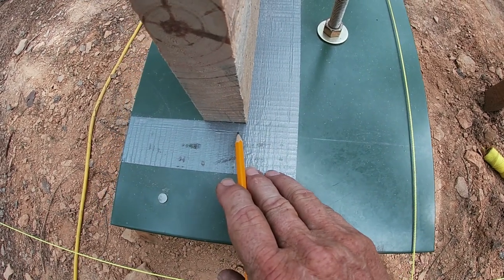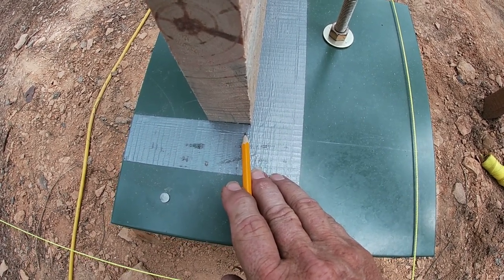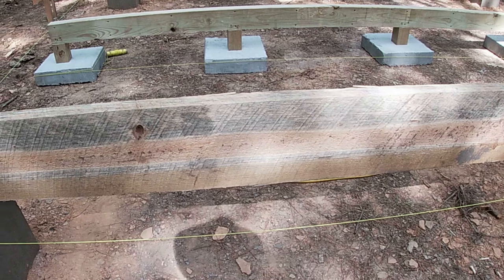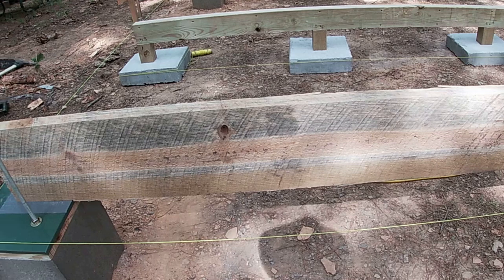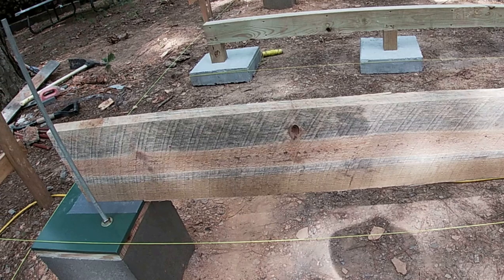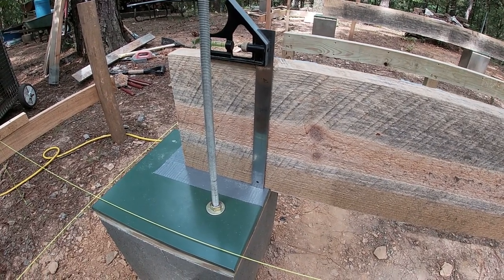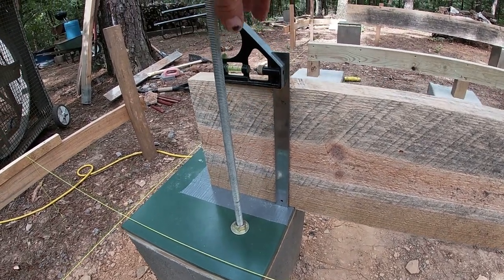It's three-eighths of an inch back from the end of this first two by ten that I've put down here for the beam that'll carry the weight of the floor. Since I am using rough sawn two by tens from the mill, they are not exactly ten inches — some are a little bit over and some are just a little bit less, so I'm dealing with and working with that. The ones that are a little bit over, you can see here, I had to notch out. I just took my combination square, set it on ten inches, and marked where I need to trim a little bit off the bottom. That'll keep all the tops of the joists even.